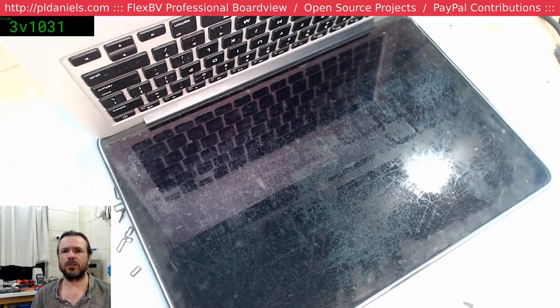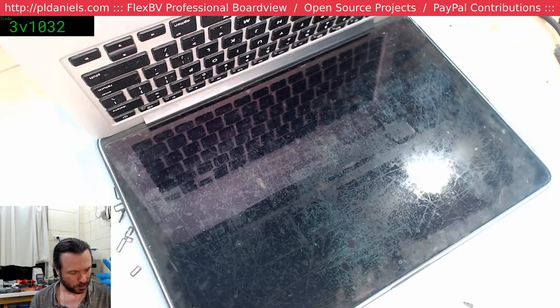Okay, I don't even know what it's doing right now. What was interesting before is it actually was showing it was running at a speed. The controller on that broken fan was telling me that it was spinning, and I could visually see it was not, because it had those broken connectors, broken traces. Whereas this one is not saying it's spinning, and it's also not spinning, so I'm a little unsure. Yeah, no, we've definitely got something else going on here now.